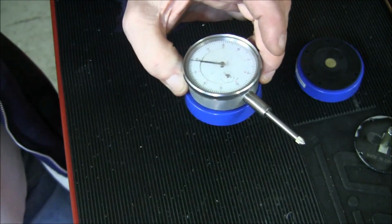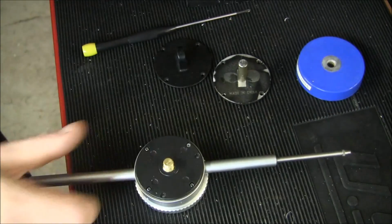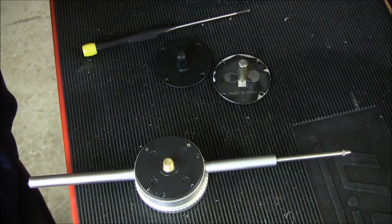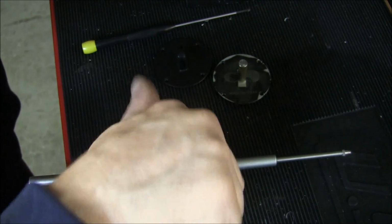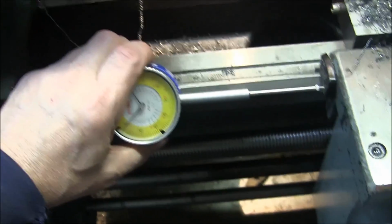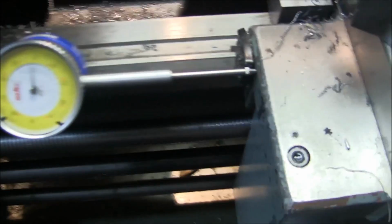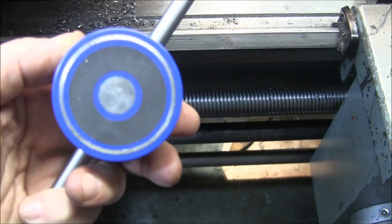Okay, put another one on. Okay, so I decided to put the other one on my 2-inch indicator. And actually this one fit. The holes aren't drilled in the center, but it fit on there without having to modify it like the other one. Okay, so there it is. And it jacks up the indicator just high enough so that it misses my way wiper. So not bad. These things were $8 and change off of Amazon. Nice.